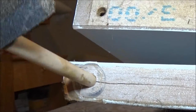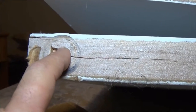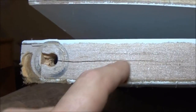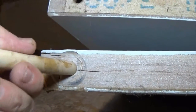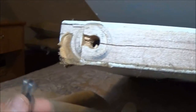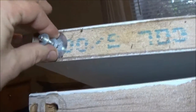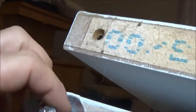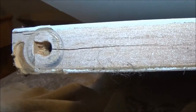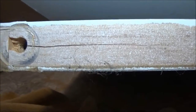See that? But this does not quite fit - I have another one that's a little bit too small. So what I'm going to do is go ahead and drill this out a little bit more, and I'm going to try to get some glue up into this crack, spread it a little bit, and get some glue up in this crack. I'll stick this up in there, cut it off, and then re-drill it with the right size drill bit. It should actually fit snug like that. See how snug that is? Well, I don't trust it. And then we'll work on the part that's down there on the floor that this goes into. I've got a quick fix for that.